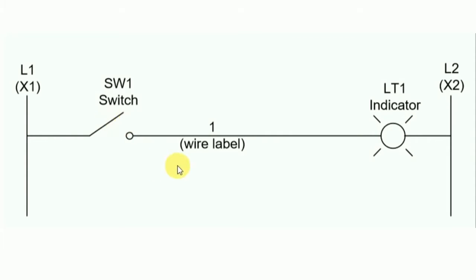This first circuit is our basic circuit — we already saw this in Part 1, but let's discuss it again. L1 and L2: L1 is our phase line and L2 is our neutral line. If controlling is on single phase, L1 is phase and L2 is neutral; if on two phase, L1 and L2 are the two phases. One lamp and one switch are connected. The lamp is controlled through the switch, which is currently open, so the lamp will not glow. When we press the switch, the lamp will start glowing, and when we press it again to turn off, the lamp turns off.